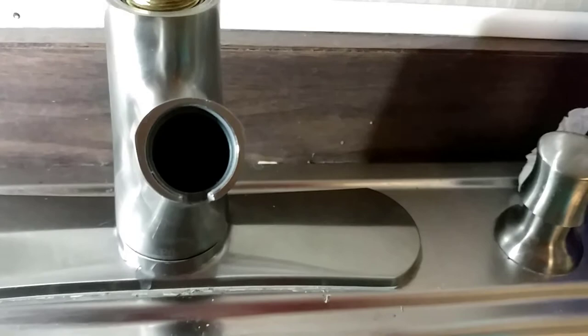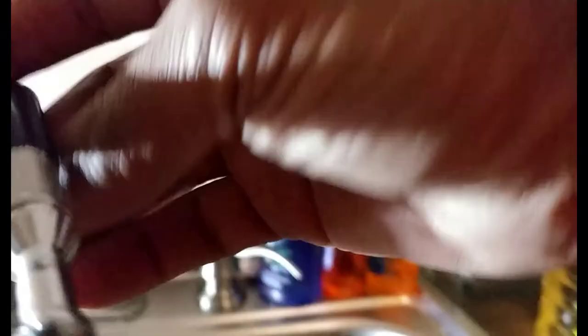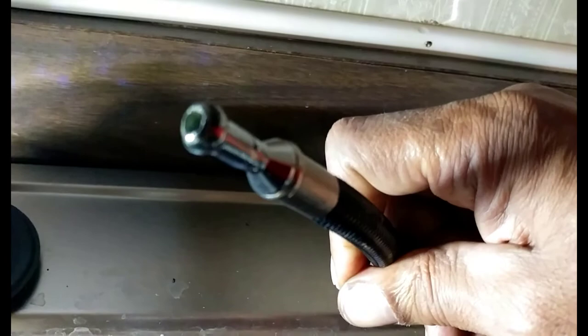Okay, we're back. What I did was I pulled that through and was able to get it through. What I did was take a little sharp knife — when it was down inside of here, I took a real sharp knife, stuck it down in that hole, and then reached around under the sink and guided it up through that center hole. Use that hole to hold on with a knife and pulled it up through. Then I stuffed a piece of paper towel down in there so that it won't drop back down. You can stuff anything in there just so it won't slide back down while you're working on it.